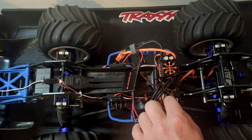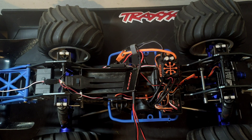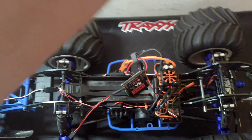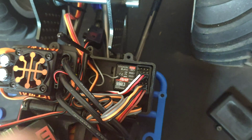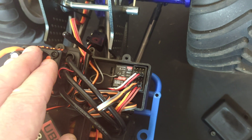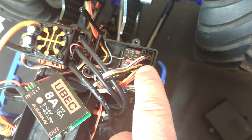The key consideration is this is only going to work if you've got a receiver that can run 8.4 volt. These BECs are very stable voltage. This receiver runs 3.5 to 8.4 volt and has a dedicated power input, so we can take one of the outputs from the BEC, plug it directly in, then disconnect the positive and negative from the ESC — so the ESC is only getting the signal from the receiver to go forward and backward, and the power is coming from the BEC. You don't want to leave both connected.